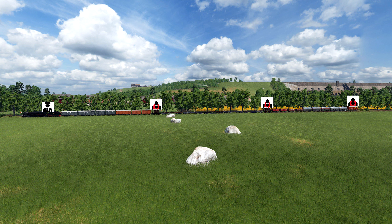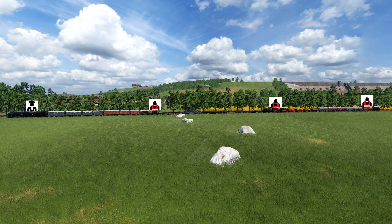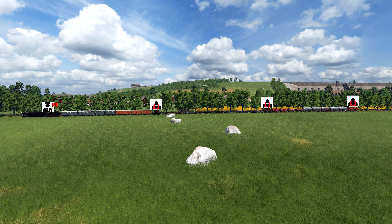Of course, this system had a lot of problems. The brakemen — the members of the train crew who applied the brakes on the brake vans — could miss the driver's signal for a variety of reasons. In long and heavy trains, there were more brake cars than brakemen, and the brakes were applied sequentially rather than all at once. The braking force of each car was relying on the strength of a particular crew member's arm.